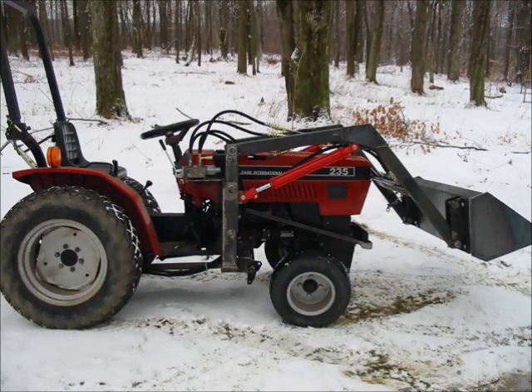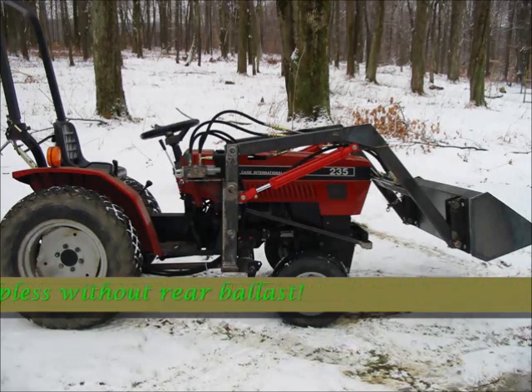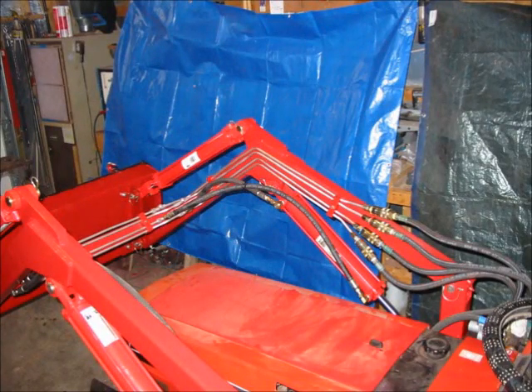This was the maiden voyage outside — I wanted to see if I had any serious design problems. As you can see, the tilt cylinders for the bucket had not yet been installed, but it was a good point to try things and get a sense of the overall concept. The tilt cylinders are now installed and I've also mounted the quick disconnects between the solid lines and the supply hydraulic line from the loader, which allow me to separate the lines without any fluid loss when I want to remove the loader.